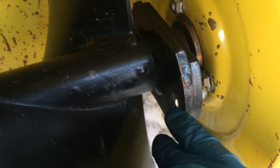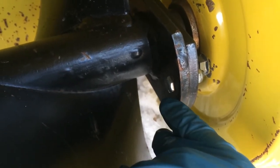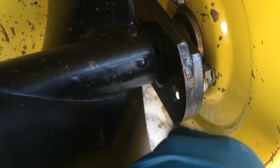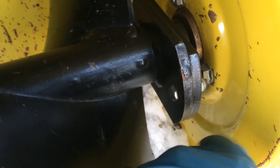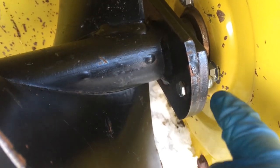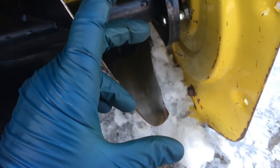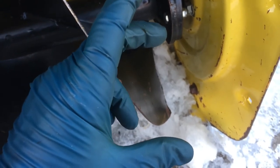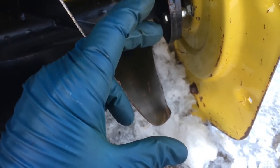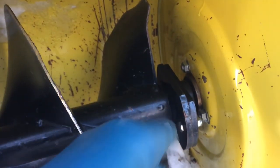So we just put it in this way. This is only the third time in almost 22 years that we've broken a shear pin, and we installed it this way the previous two times, so that's how we'll keep it. What happened on this particular auger is we got a rock about that big — a big old cobblestone style, 3-4 inch rock — and it just got in there and got jammed, so it broke that pin.